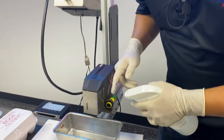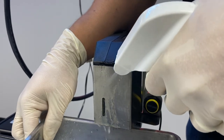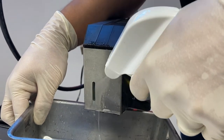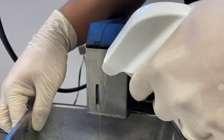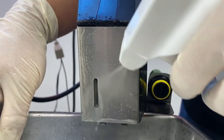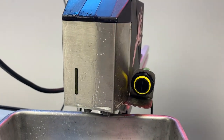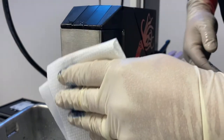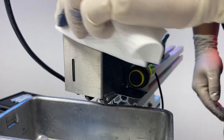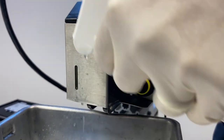With the sprayer in hand, turn the printer off and start spraying down the printhead. You'll see it move that egg residue as it goes along — just keep going until you can't see anything. Get in that faceplate right on the engine, and get it off the entire stainless steel faceplate. Once you think you've got most of it off, take your lint-free wipe and dry the face as much as possible. Take a look, and if you need more, go ahead and spray more.